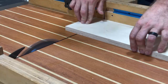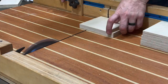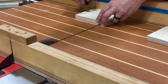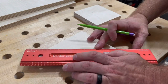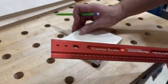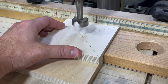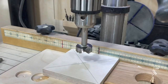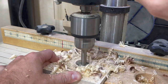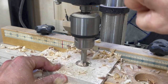I like to use scrap for a lot of projects and this one is no exception — I didn't go to the store for anything except the speaker itself. We're cutting down pieces of Baltic birch, three-quarters of an inch, to five-by-five pieces and finding the center. I set up a stop block and a jig on the drill press. We're going to drill a hole in one piece with a diameter of about an inch and an eighth, and three holes in the other three pieces with a slightly larger diameter.